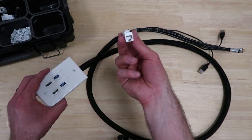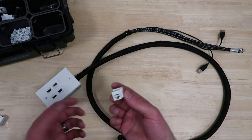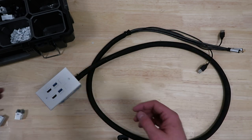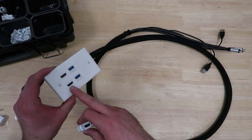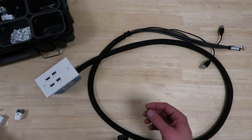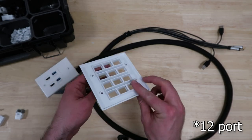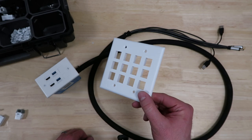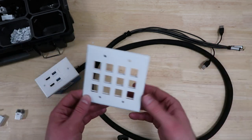You could imagine that in these two empty spots I could have two of those. What's interesting is they come in all sorts of other connector styles. Here's another ethernet one but it's a punch-down style. And then HDMI - you could plug in an HDMI cord to each side, that's obviously what I'm using here. They have USB ones, that's what this is. And there's all sorts of different plates - here's a huge six-port plate that you'd use in a double-gang box, traditionally in something like a surround sound setup for your TV. The possibilities are as endless as you can come up with if you have an idea for connecting two things together.